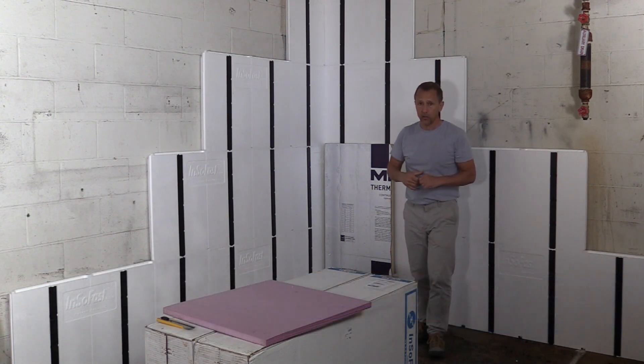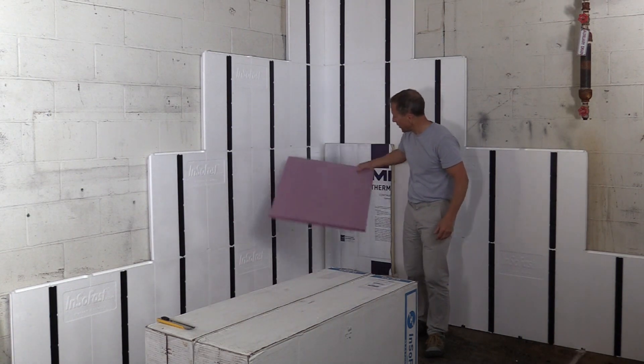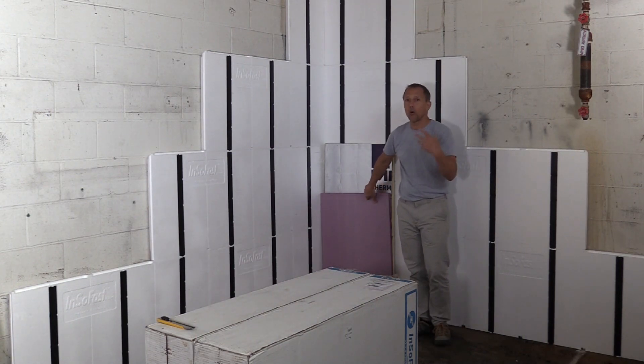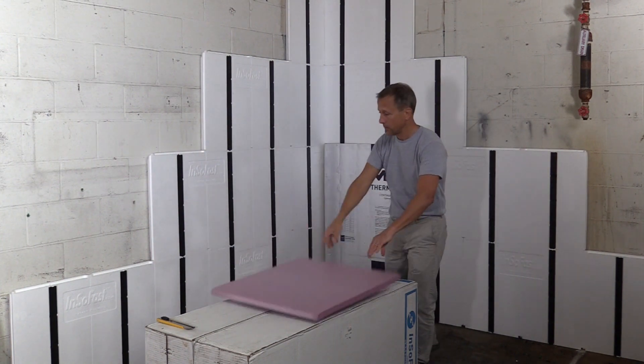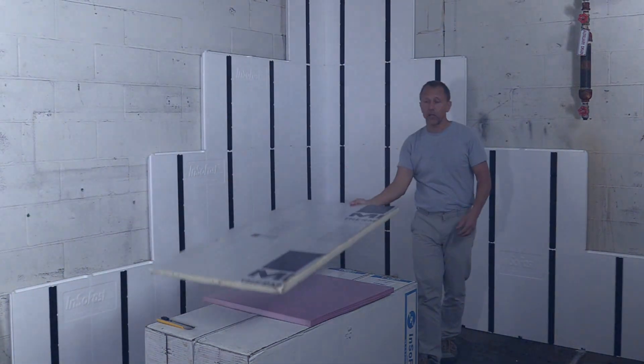That's the way to increase it. If you want to add more insulation, you can add another layer — that would be 2 inches, and that would give you another R 11 on top of the R 8.5, so you're around an R 20. It doesn't matter if it's a Styrofoam type product or a poly iso type product — you can add as much R value as you need.